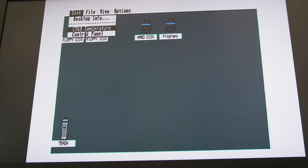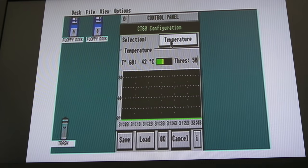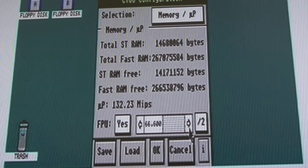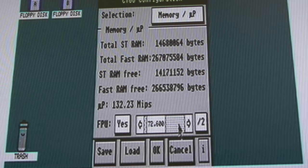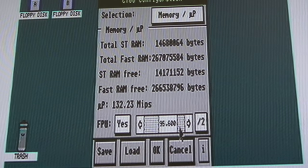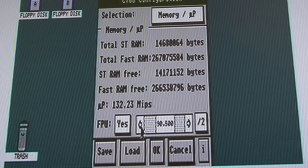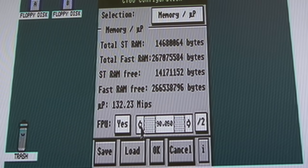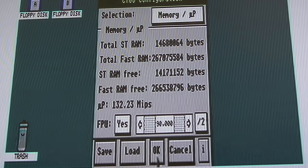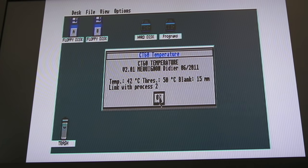When I clocked this at 90 MHz — let's just do control panel and go to CT60Config. Strangely it's in the memory settings, but it says 66.6 MHz. If I click across to 90, this does run at 90 and runs really well. You can go past 90 — good god — let's just go back down to 90. I don't want to go beyond 90 at this stage. Apparently some of these can go to 105 MHz, which is crazy. Let's click OK.